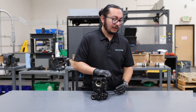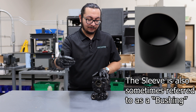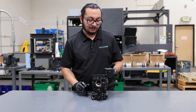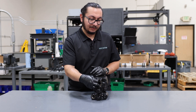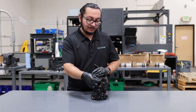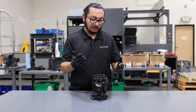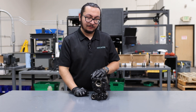When running it as a three-line system, it's very important to include the sleeve so that the flow path of the oil will be correct. Sometimes customers leave the plug in and include the sleeve into the suction — the sleeve blocks off flow of a certain path. If you include the sleeve in a two-line system, the pressure will get too large, all the seals inside will get blown out, and that's how you'll end up with a failed pump.